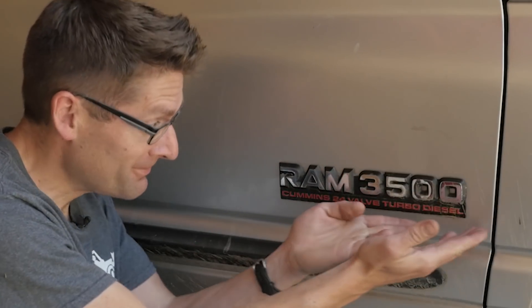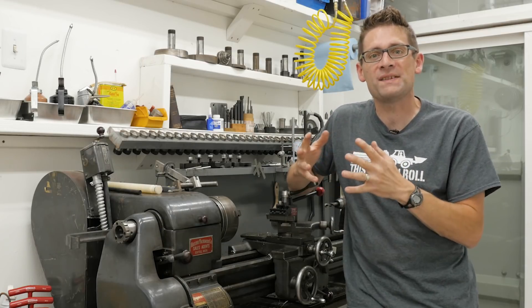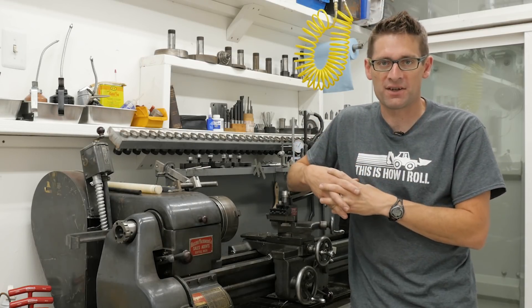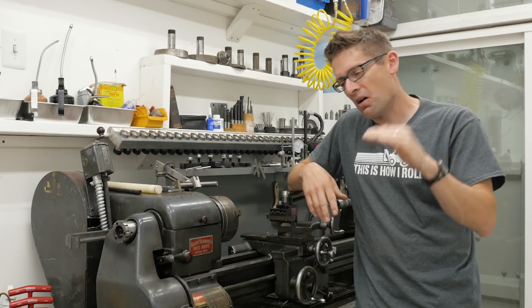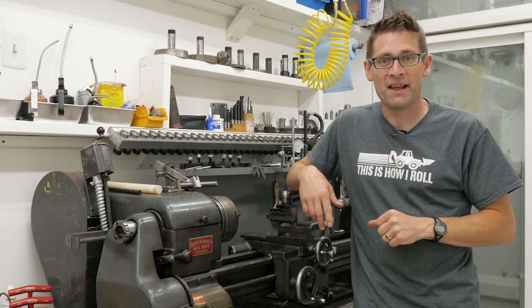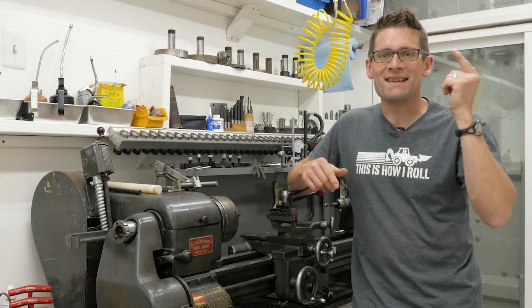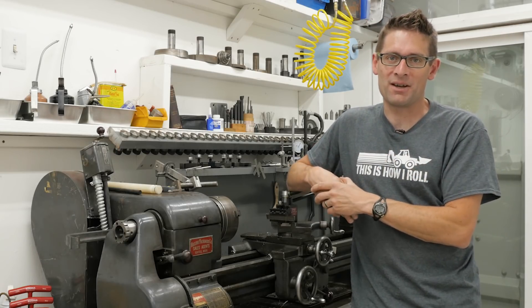I love my truck. I absolutely love my truck, but there's been something that's been driving me crazy lately, and that's the clutch safety switch. I have to push the clutch all the way to the floor, crush the carpet, then push a little bit harder in order to get the starter to engage. I checked — it's not adjustable, this clutch safety switch.